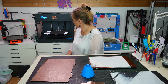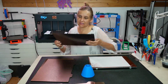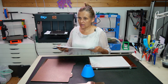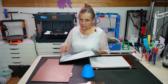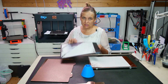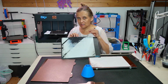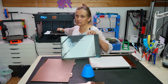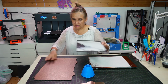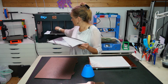And another thing is, there are companies selling beds, they say that they have the size available for a Craftbot, but they have 374, which is the right width, but in the depth they always use 250. But in reality, the depth of the bed is 258. So this is why I made my bed exactly the depth of the bed here.